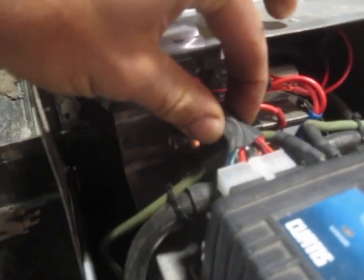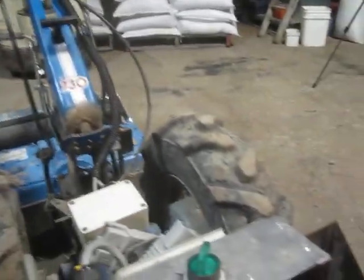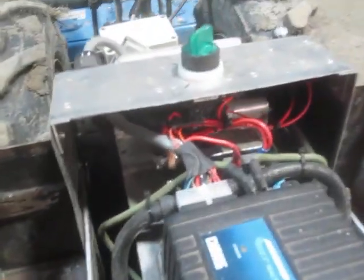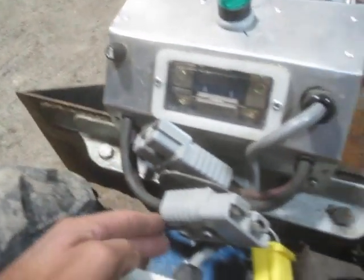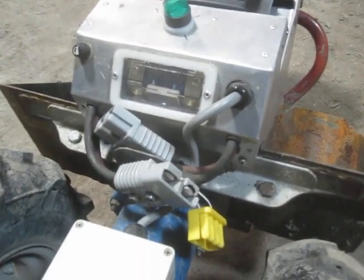There's a combination of logic wiring that runs up to the various controls and interlock switches, and also to the switch and the fuse. Small-gauge logic wiring, and then larger-gauge power cables down to the motor armature. Also larger-gauge power cables that come out on each side to run to the high-current SB connectors for the battery connection.